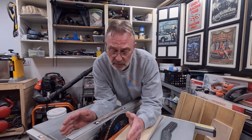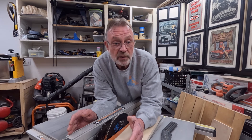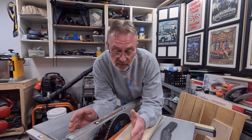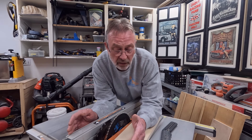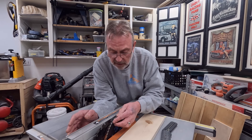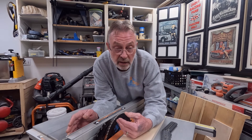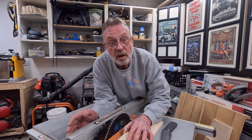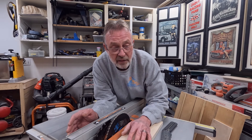They preach wear ear protection. When I'm using a table saw, I do not like to use ear protection because I like to hear what the saw is doing — I like to hear the tone of the machine. Then I know if I hear that tone or pitch changing that something is going on. So either my blade has become dull, or my blade is plugged up with sap — I work with a lot of pine, and that will sap up your teeth and the blade needs to be cleaned periodically. It could also mean there is a harder spot in the wood. I like to hear that pitch and tone stay consistent while I'm cutting. If I hear the saw bogging down at all and I know I'm not pushing the board any faster, then I have to assume I'm hitting a hard spot.